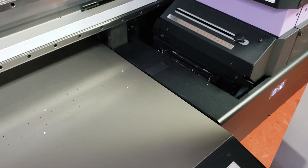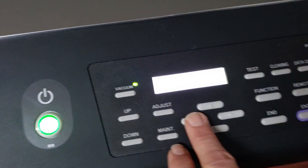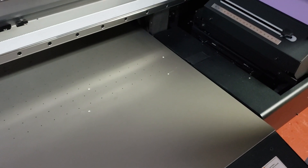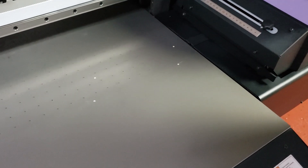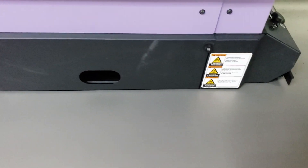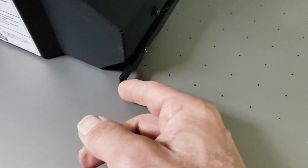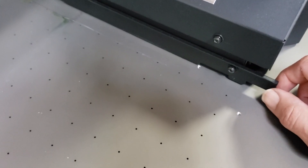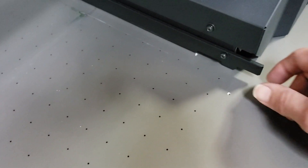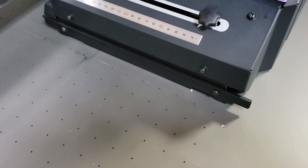The next step is to hit End until you're back at Local mode. Now we want to bring the crash guards out over the deck. These are our crash guards — the crash guard is set one half millimeter below the printhead and one millimeter above your media. What happens is if people lean on this or it gets bumped repeatedly, it can get out of calibration. So we're going to verify and calibrate these crash guards.